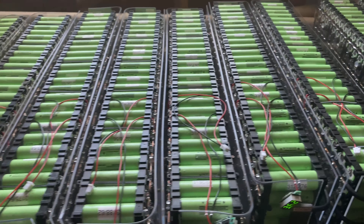Really quickly — I kind of forgot to show you the back side. This is what it'll look like in the back. Before I mount the back panel, the shelves will slide right in between here. I'll drill a hole through here and use longer screws that go through both pieces and the wood, so that should hold it down. I'm not sure if I want to paint it or not — it kind of looks nice like this. I might paint it black. What do you guys think?